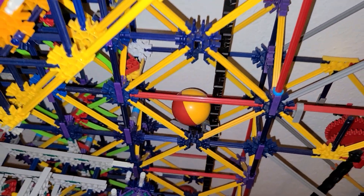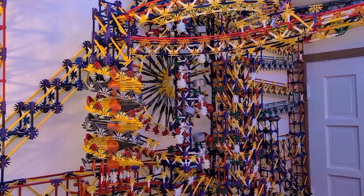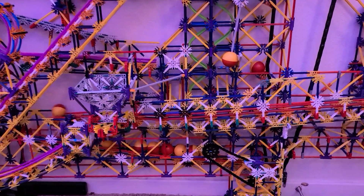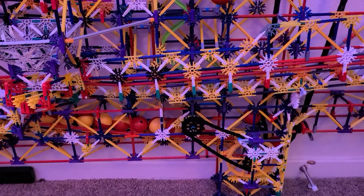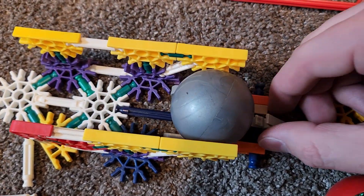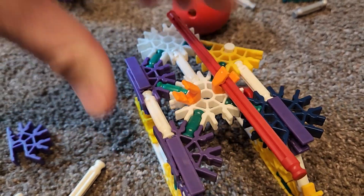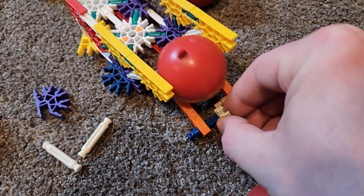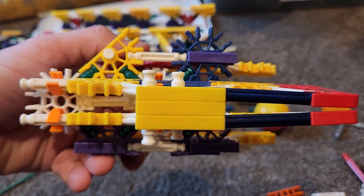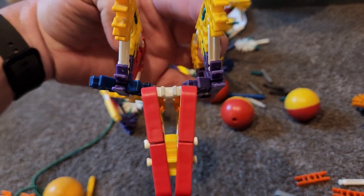For this machine, I've decided to go with a classic big ball factory style chain lift. I'll be going into a lot more detail about why I made that decision in a couple of episodes, but suffice it to say that I want a lift that's reliable, repairable, and redundant. In order to determine the height of the ball return ramps, we need to know the height of the ramp that loads the balls onto the chain. Usually that might look something like a simple track with walls on either side and a tongue sticking out the middle that allows a forked chain hook to pass through. However, this simple design would be prone to breaking. Using longer rods attached to the bottom with orange clips might work, but the spacing of the rods interferes with the spacing of the chain hooks just a little bit too much. Replacing the rods with a simple truss that is squished together at the bottom using white rods solves that issue quite well, and provides a nice wedge shape to help align the chain hooks as they pick up the balls. The truss design also allows for a stop to be built onto one end of the tongue to securely hold the balls in place and prevent them from bumping into the moving chain as they wait.